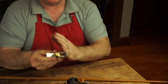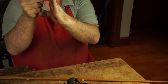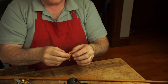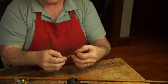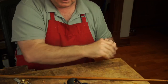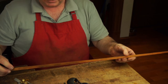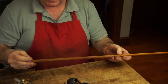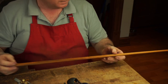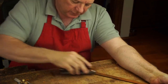Yeah, I mean, this blade is standing up pretty straight, about like that, the blade angle. So it really is scraping more than it is cutting, you can see. Like I said before, Pernambuco is not the friendliest wood when it comes to planing. You guys that get to plane that silly spruce stuff all the time, you got it easy. Okay, let's do these top two facets.